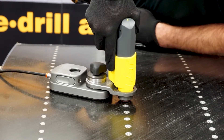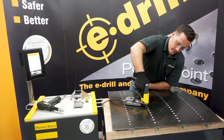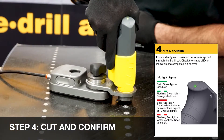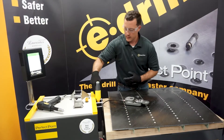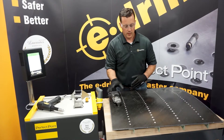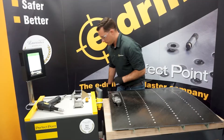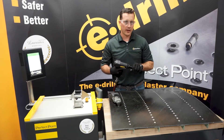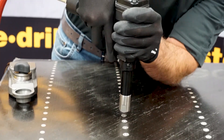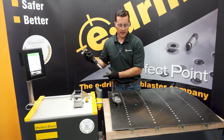Push down to make that nice watertight seal, pull the trigger to start the cut. Let it hold for three seconds. If there's a little bit of excess water, no problem — just wipe it away with a rag. Then take the air punch — I've already got the eight plus nose piece on — locate center on the fastener, pull the trigger, out comes the fastener, and left behind is the head.